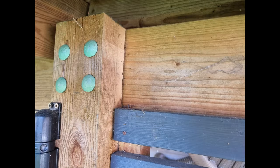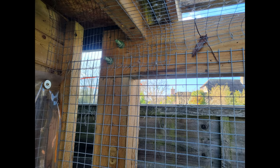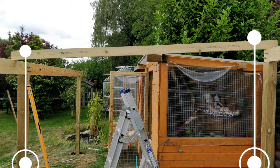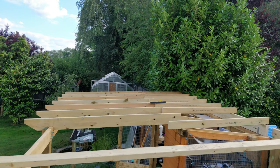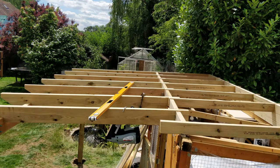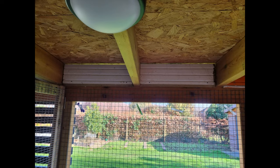Where a post sits two beams, four bolts are required. At the end posts where there is only one beam, only two bolts. When setting the rear posts, remember they will need to be higher than the front ones to ensure a sufficient angle or pitch of the roof. We then cut all the roof joists from lengths of 6x2 treated timber. The joists are notched so they sit on the cross beams and the end is angled for aesthetic purposes. Once all joists are in place, fill between them with noggins — this adds structural rigidity but also stops the ferrets climbing out between the gaps.